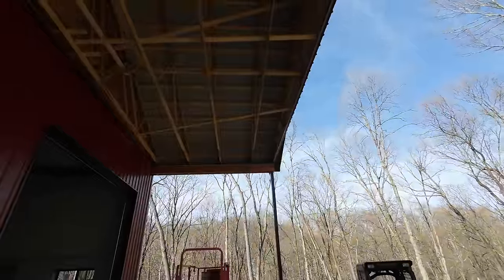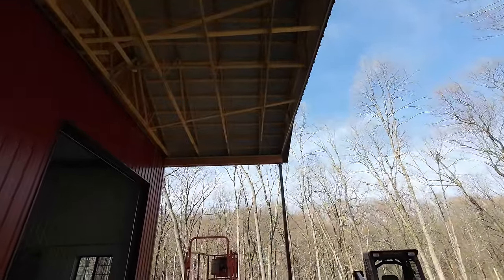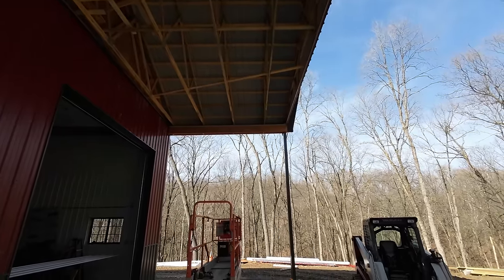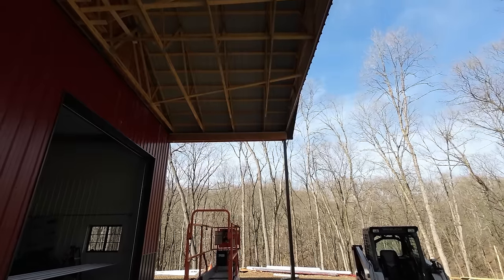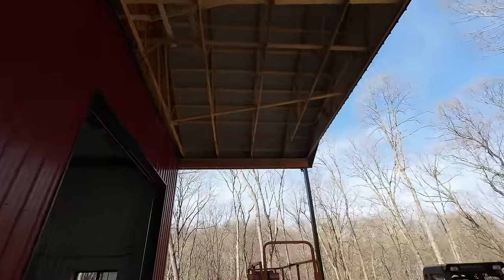What I imagine happened is they put them on the wrong side of the line. When you lay out for trusses, you pull your tape measure out, and whatever centers you're running the trusses on, you put a line, and then you put an X on the side of the line that the truss is supposed to land on. I think somebody either put the X on the wrong side or put the board on the wrong side of the line, regardless of the X.